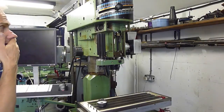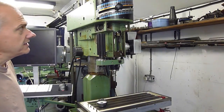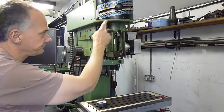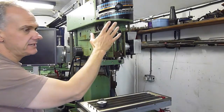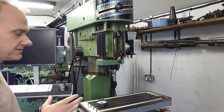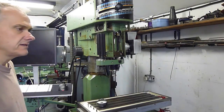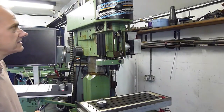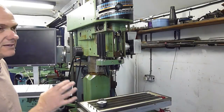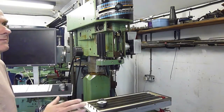Here's just a quick video to show the spindle speeds on this thing. My initial thought was to keep the Reeves variator around the 2000rpm speed position for the highest speed on the motor. The motor has four speeds: 450, 700, 900, and 1400rpm. By pulling it at the highest speed being 2000rpm from the 1400rpm motor, by doubling the speed of the motor I'd be able to get 4000rpm as my top speed, which for most applications for non-ferrous and so on is going to be absolutely fine.